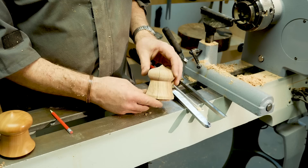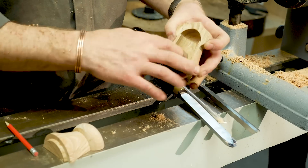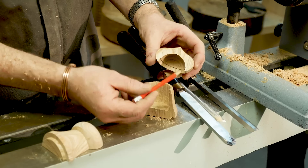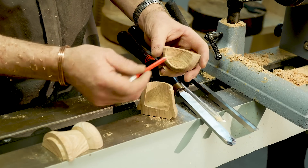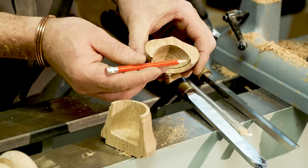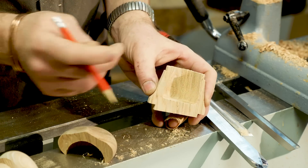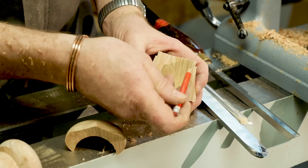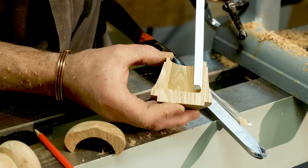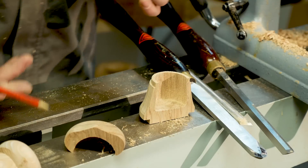At this stage we've got our box — you would have sanded the inside. We can jam chuck the base and reverse it. We've cut it in half to show you the profile. So we have our lid — our nice curved shape. Nice clean finish, this is straight off the tool, no sanding at all. Good profile, nice and clean. You can see the nice straight lip off that skew chisel — the narrow section on the skew chisel allows us to get right into the corner. On the base, that radius corner gives us a nice clean side and flat bottom across the base. Again quite tricky to do with certain tools — it makes it so much simpler to use one tool to do both tasks. With the tool being straight and not angled on the tip, you're in line with where you're cutting.